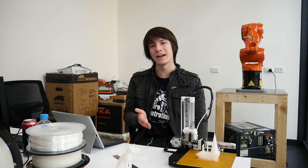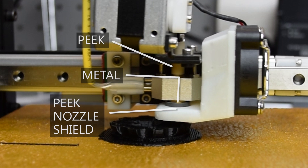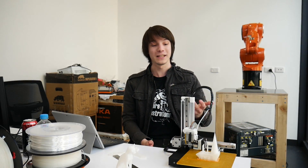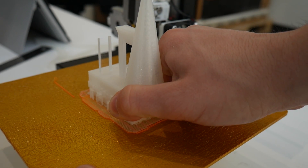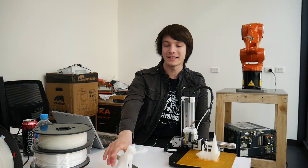So what's going on? These are different brands of PLA that I know work beautifully on other machines. I think it has something to do with the extruder design. The Cetus has an all-metal hotend with no PTFE lining, and I think this design doesn't work with all brands of PLA. Some PLAs, when they soften, produce their own plug by sticking to the walls of the all-metal hotend — the plastic tries to force into itself, pressure increases, and the stepper motor clicks. This might be solvable with an oiler, which I haven't tested yet. Interestingly, after switching from the orange PolyAlchemy to the no-name Wanhao PLA, it printed beautifully. So most of my test prints were done with that PLA.